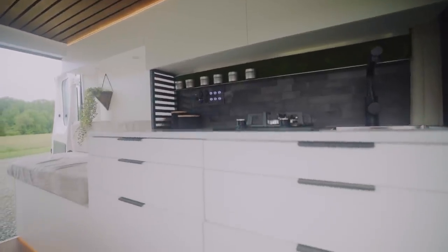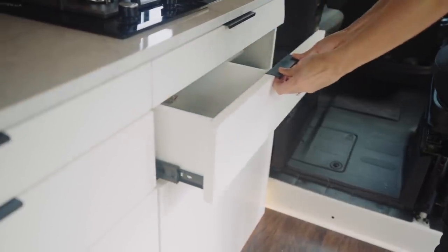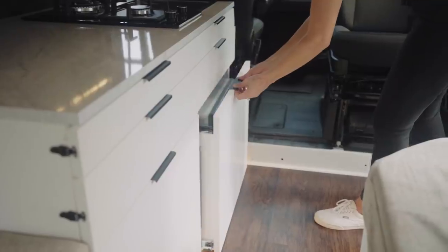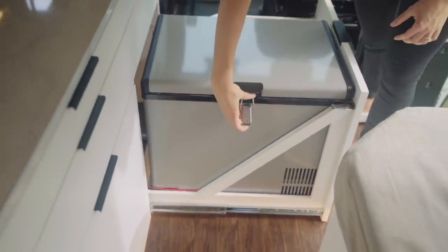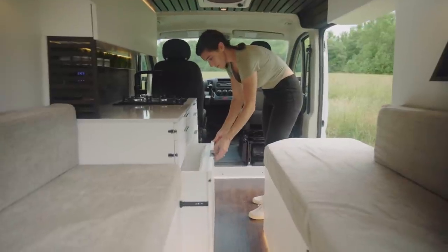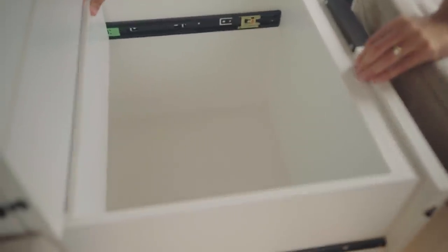Below the kitchen area, we also have four more drawers that offer even more storage options. In a space this small, drawers can make or break you. We custom designed ours so that we would be able to make the most of the space as possible. For example, one drawer is only a partial drawer due to the fact that the sink sits lower there. Another drawer was created with the dimensions of our 45-quart fridge in mind. Our fridge runs off 12-volt like the rest of the van and draws very little power. We found that custom cabinetry is without a doubt the single most difficult and frustrating part of a build, but if you truly want to utilize every space possible, prefabricated cabinets just won't cut it. One drawer divides in half to give you two drawers with the appearance of only one — this is the kind of stuff that takes a ton of time, but in the end is very rewarding.